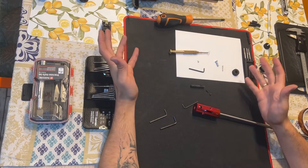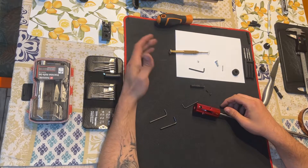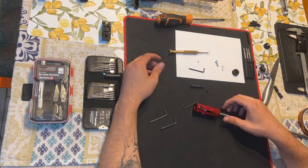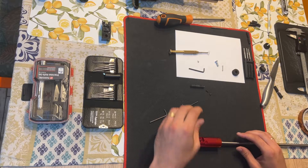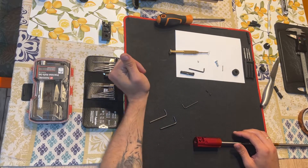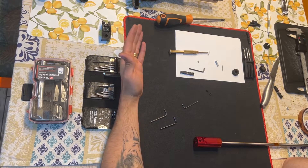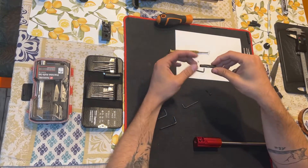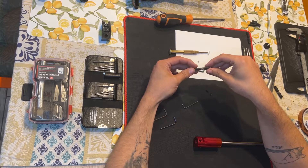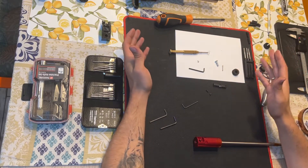It has quite a few parts printed in 3D and also reworked afterwards, because the parts need a lot of tolerance. Unfortunately the printer is not that precise, and even if it is precise enough it will print a little bit warped, since the PLA expands and after a while it shrinks, so all the parts need a little bit of sanding.